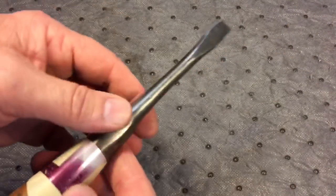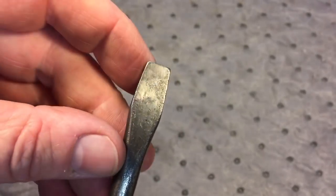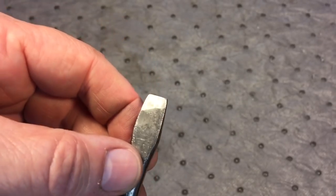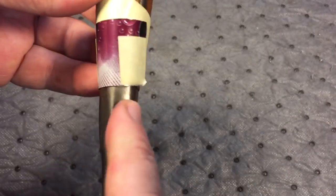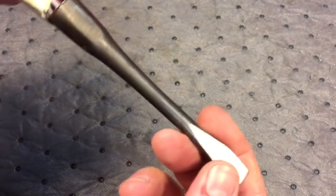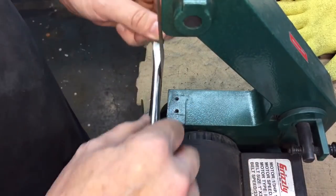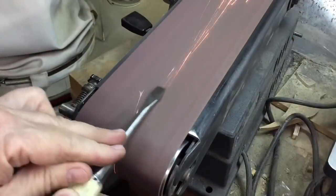Here's our wire brush evaluation. You can see that the steel looks real good. However, this was an attempted regrind — you can see the facets here on the tip of the screwdriver. We'll have to address that. People regrind it to fit a certain screw, but we're going to get that going straight across. You can see there was some kind of coating years ago, but we're going to take that to the belt sander, and then we'll hit the wood also. The back looks pretty good, but the wood is going to be a little more difficult. Here we just make sure we get each one of those facets on the belt sander so that we're not rounding it over, and then we address the tip on the flat belt sander.